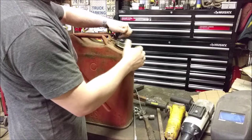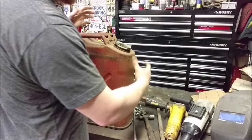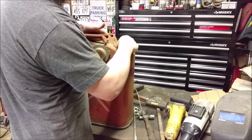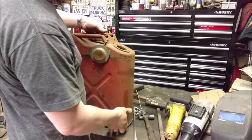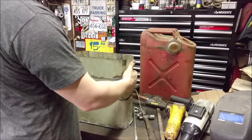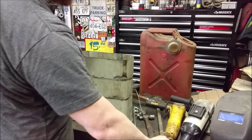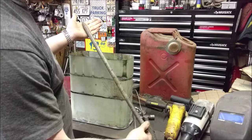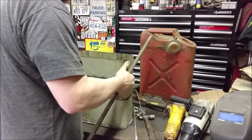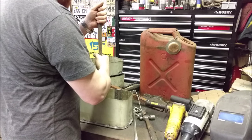What I need to do is make a mechanism that actually holds the toolboxes up inside so that you can carry this entire unit around. But also when you want to release it, if you set it down, you'll have some sort of mechanism that you pull or push and it releases this, and then you can pull this entire thing off. What I'm going to do is actually have this solid steel — it's actually a cement form stake — run through all of them up through the center of each one. It'll fasten and become a permanent fixture of the bottom one, so it'll be welded to the bottom unit.